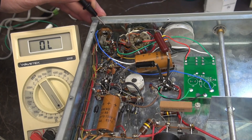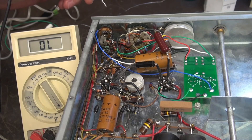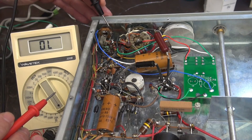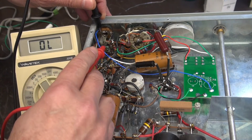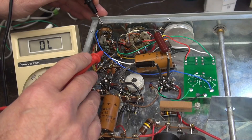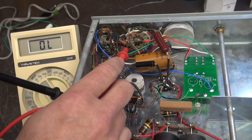I've completed the wiring on the new quarter-inch microphone input jack — these are referred to as a TRS phone jack. They have a ground and two conductors, like a stereo jack with tip, collar, and ground. Ground is the bottom tab. The microphone audio input will be on the collar — midway down the plug. The push-to-talk voltage when you key the mic will be on the tip. The reason you want it this way is so that when you plug in the jack, the 12 volts from the push-to-talk circuit does not go to your mic element and damage it. This is common practice.